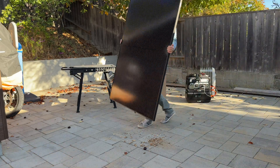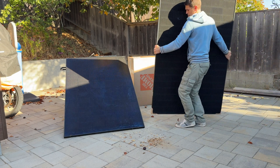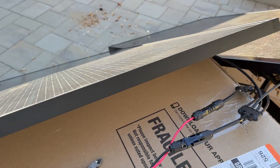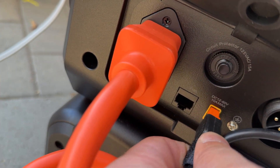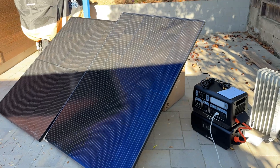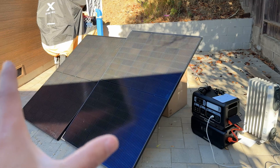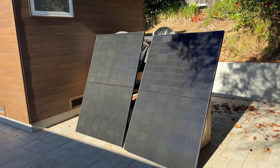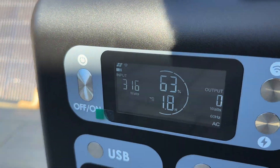For solar charging I have two solar panels, 400 watts each, connected in parallel — they are shaded right now. We're getting 118 watts with panels half shaded. After adjusting the angles, with panels still partially shaded, we're getting 320 watts.